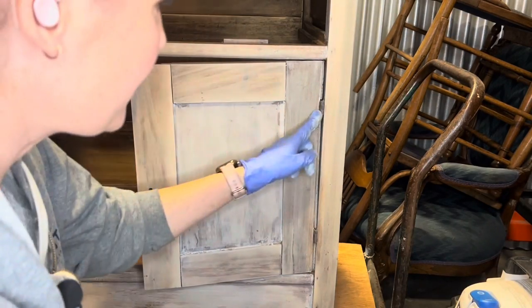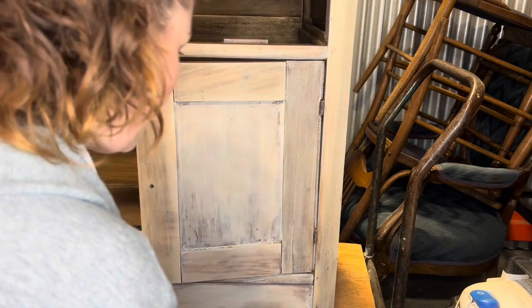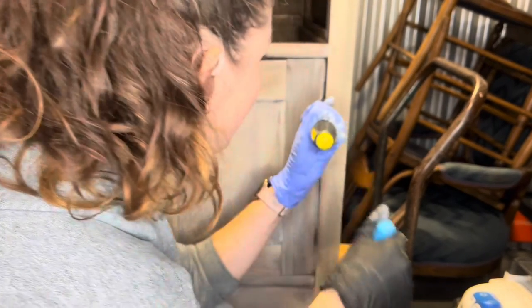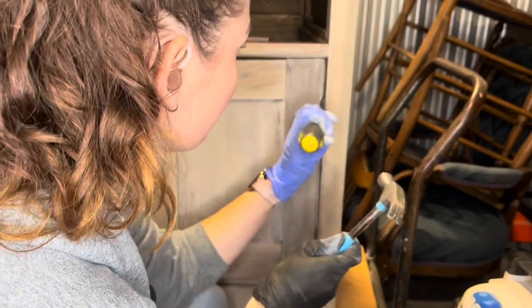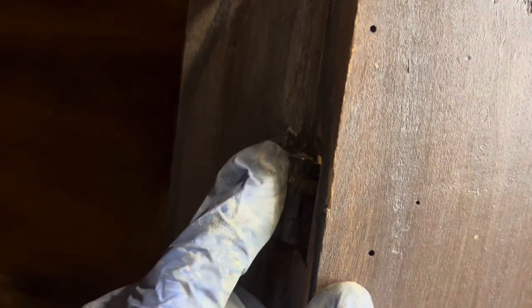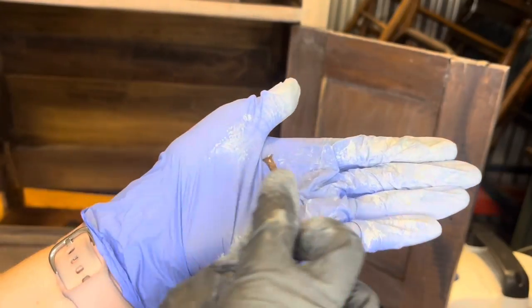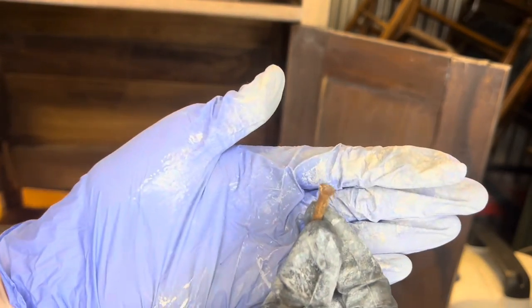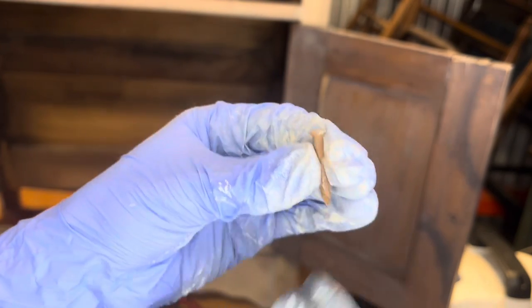I know I said I wasn't going to take off the hinges, but this one's just too loose, so I'm going to try and get this one out without destroying it. This is a really thin screwdriver and I just need to get a little wiggle in here. I've got this top one mostly out — it is huge. So I'm going to get that the rest of the way out and see what we can do about tightening it up. Those are the nails that they used on the hinges — they do have little ridges to help keep them in, but of course they're old and obviously are no longer working.